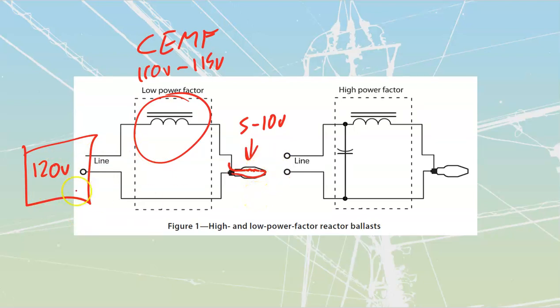As a result of that, these values that I have in here, 120 volts and 208 volt, oftentimes aren't going to be sufficient to light. Some small, really, really small little 70 watt high pressure sodiums can be lit off of them. But if we're talking about one of those big bulbs, the 400s and the 1000 watts and stuff, you're going to have a much higher value of voltage. You're usually going to be looking at your 277 or your 347 volt classes that you are going to utilize for those in order to get that strike across there, and then after that to limit this down.